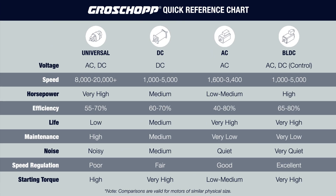Let's look at the quick reference motor chart. Remember the importance of prioritizing your application criteria? That's what we've done here, highlighting the characteristics that meet the application requirements. A brush-type DC motor wouldn't meet the life requirements, but the AC and brushless DC motors would meet or exceed all the criteria. Since the application didn't need the high starting torque or variable speed of a brushless DC motor, the AC motor was the cost-competitive solution.